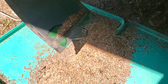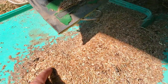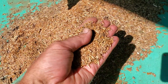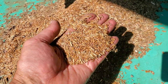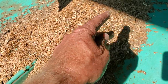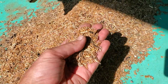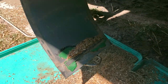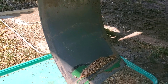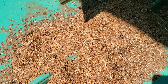This is basically going up into the clean grain tank. Given the other samples I've seen of kernza, that's really good. Maybe I should have turned the fan down a little bit — I don't see enough stems in here. Maybe it could be a dirtier sample and maybe I was blowing some out the back. That said, it threshed really well.